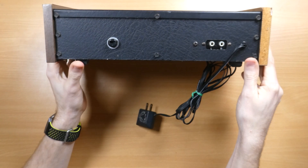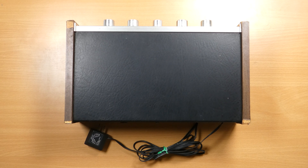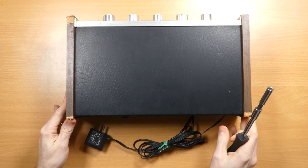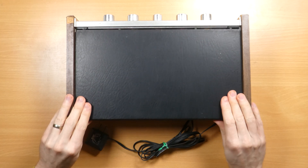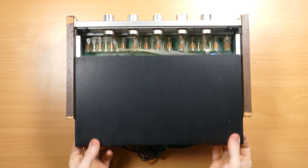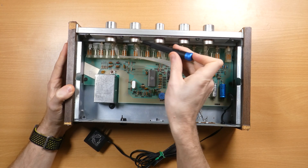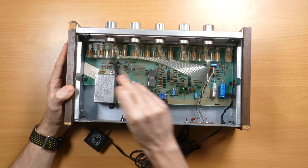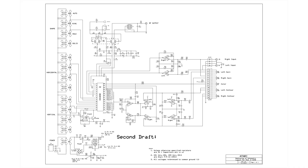So to get our first glimpse inside, we just need to remove these three bolts that attach the lid. As they're not standard screws, I'm not sure I have the correct tool for this, so I think I'll have to improvise. Now the lid is off, we can have a poke around inside. First up, we have five potentiometers connected by a ribbon cable, and underneath those, some lovely chunky switches. In the power supply section there are two rather substantial axial capacitors which, it would appear from the schematic, are actually decoupling caps — I'm not sure why they need to be so big.